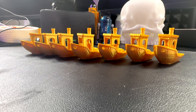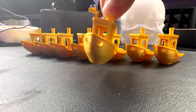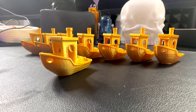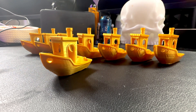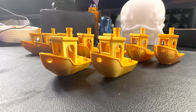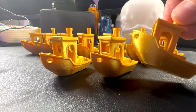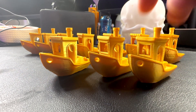The row at the back here are stock Benchys printed at 17 minutes. The support team suggested that re-slicing might solve the issues and even sent additional G-codes to try and better the prints. The belts were also adjusted up and down throughout these tests, and in fairness the echo was still apparent. We tried their beta silk slice G-code and a range of 25 to 40-minute Benchys, and this is really where we started to notice some changes.